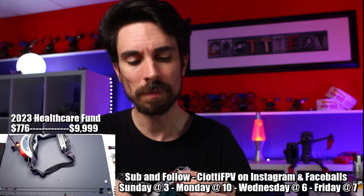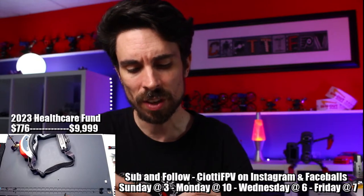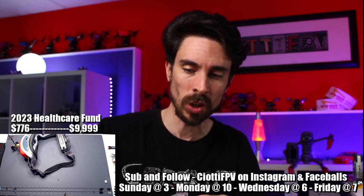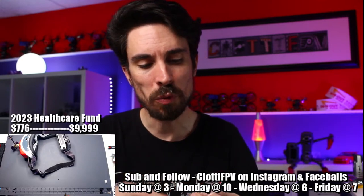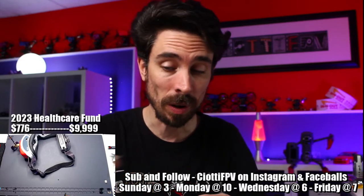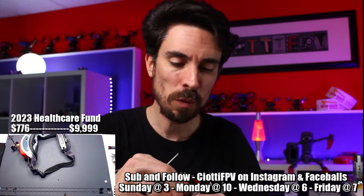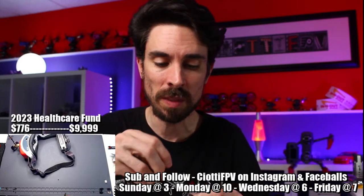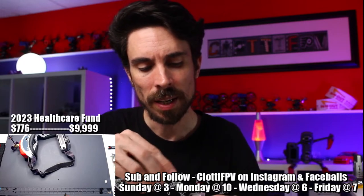And then the last value is maximum stick rotation. Keep that low, like 600, 700, 800, unless you want to fly super thrashy, but it doesn't really sound like you do. Yeah, you just need to spend some time with rates. And then you mentioned throttle resolution. Throttle resolution can be greatly improved with throttle expo. Again, we're talking about expo. Or just stick time. Stick time is really the thing. Throttle resolution is the hardest thing to learn in all of FPV, and so stick time is really the answer. But throttle expo, when set up properly, can certainly help.